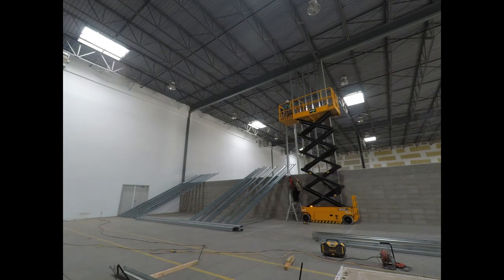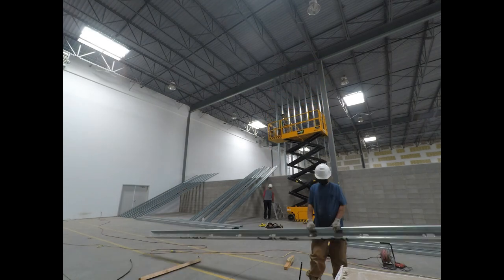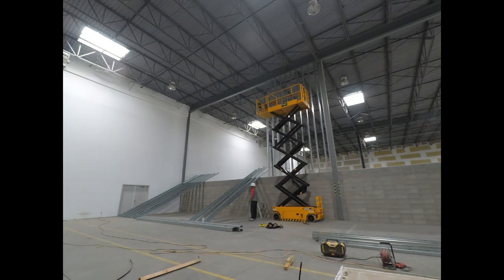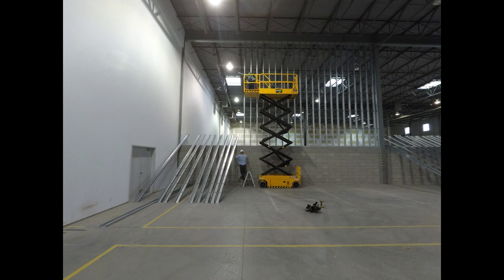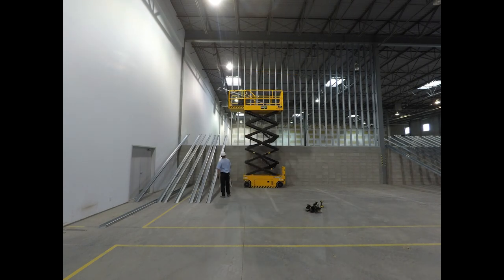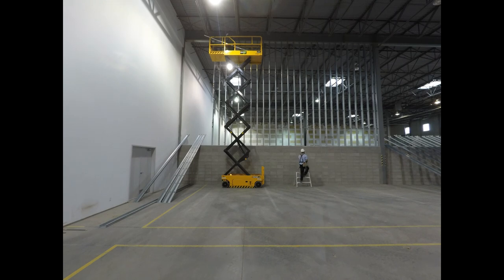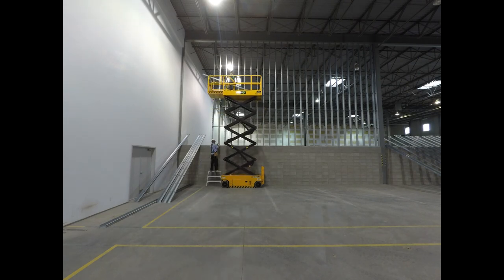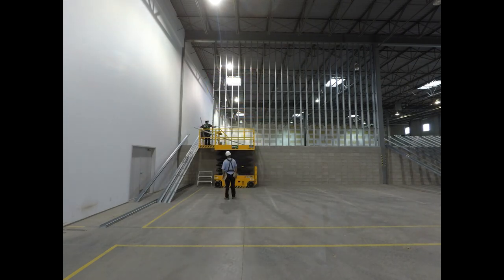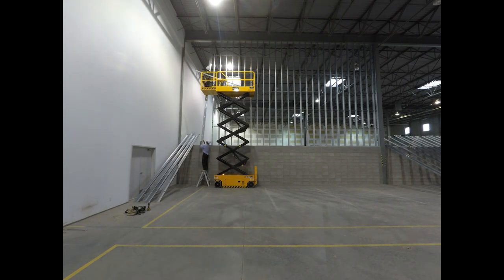Watch this time-lapse — this is how we pass them up. We went stud by stud. I go down about halfway, Aaron pushes up the stud, and we both work to pull it up together. Then I go up a little bit to the top of the stud, go forward, and he comes into the bottom track. We have to angle the stud to get it into the track. I put in enough studs so I can go all the way to the top for however long my lift is. Then I go up and screw all the studs in at the top track. In this case I'm actually pre-drilling them first. I'm loading channel as I go — pulling it with me — so when I'm done with the wall I can go back and snap it all in.